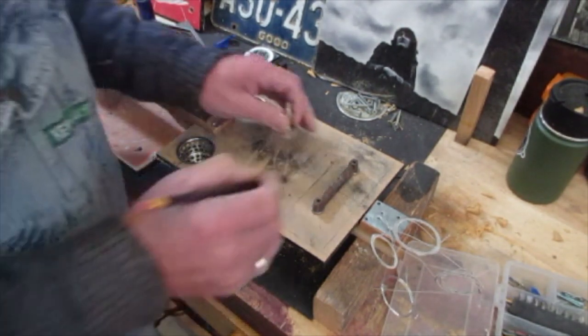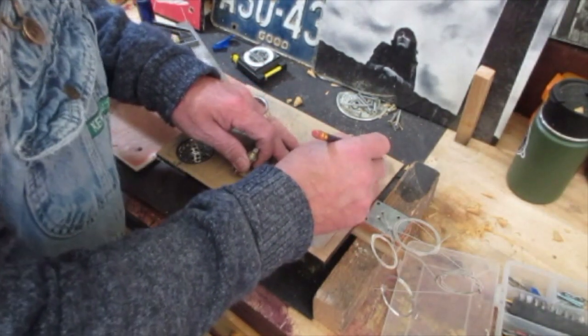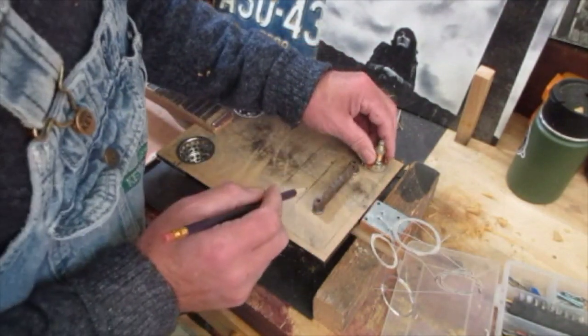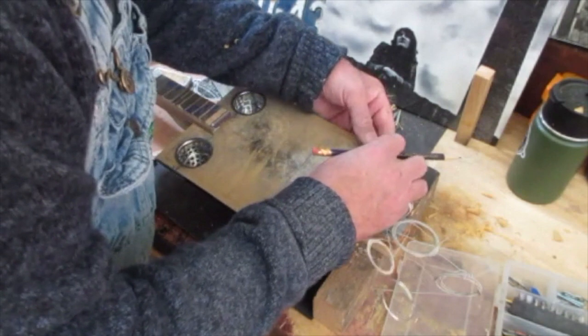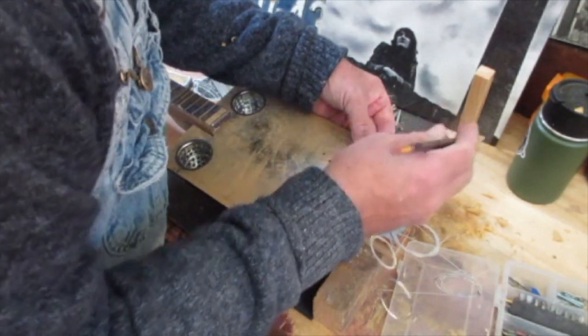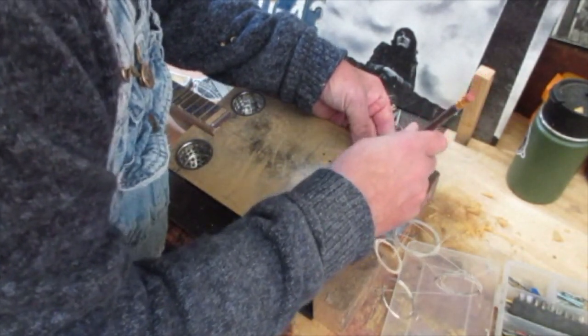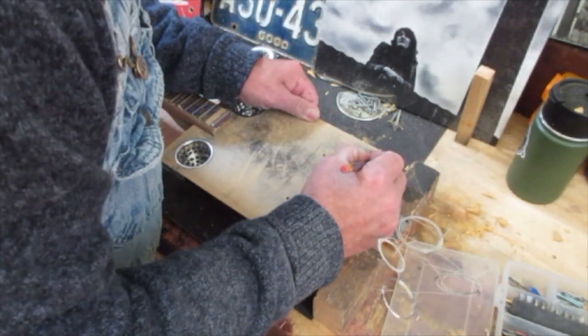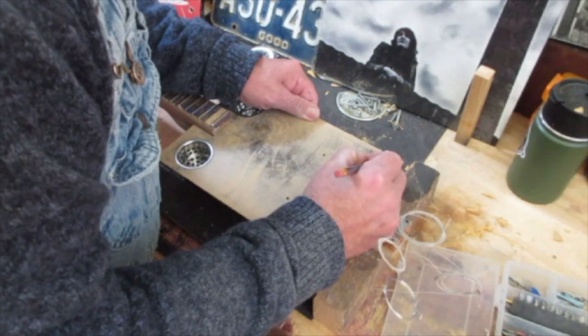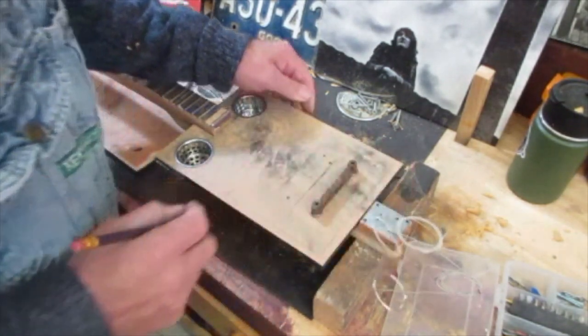Once I get the coil positioned, I go to the side of the box and make marks for the wire hole. I'll line that up and put a hole there for the wire to drop down right there. Now I've got to drill mounting holes for the coil — we're using small bolts with nylon insert nuts so they stay tight. These pots have a long shaft because the Camacho box lids are thick. The edge-thickness lines come in handy — there will be two pots, and I lay them out to make sure we're off both edges a little bit, then draw a circle.